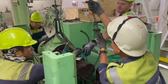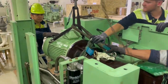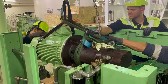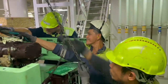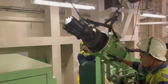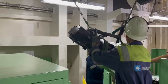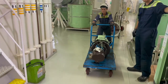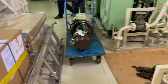We have connected the strops or slings in such a way to get as best as possible a straight horizontal lift. To remove the whole unit safely, we have used the other chain block to pull it to the other side and lower it down safely onto the trolley. Next we transport the motor-compressor assembly to the workshop.